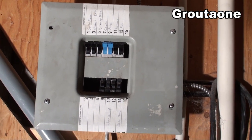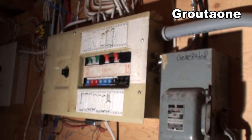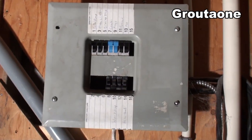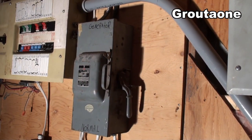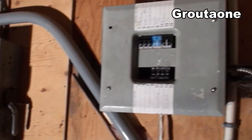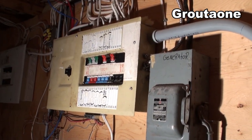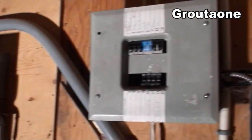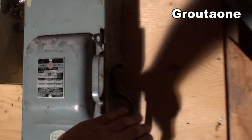So I can choose where this panel gets its power from. I can take power from my main panel, or I can take the power from the generator — my generator can supply this box if I want to. All I do is use a power transfer switch to decide where it gets its power from. Right now this small breaker box is getting its power from the main panel. But should the power go off and I fire up my generator, I need a quick way to energize all of those breakers, and that's what this power transfer switch does. I'll open this thing up for you guys.